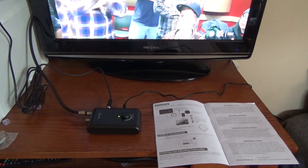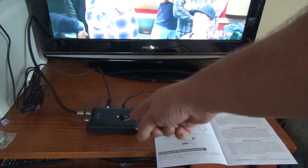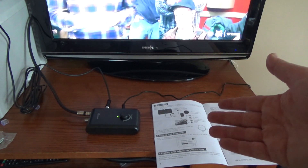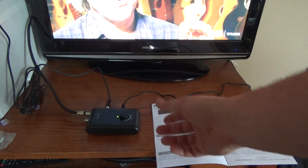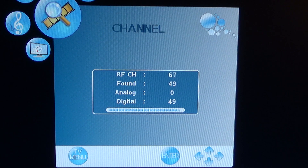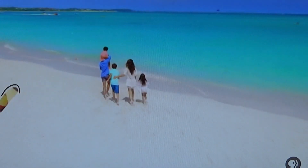We've got everything hooked up with our flat panel. I've got the gain or boost set to minimum. I don't actually know why or when you'd want to adjust that — it's not really covered in the manual, so this dial is a bit of a mystery. We're going to try it at minimum, maximum, and maybe in the middle, and just see if we get any different number of channels or any better quality. At minimum gain we can pick up 49 channels — more than the UFO got. But again, this is a directional panel antenna and I'm aiming it toward where I know there are TV towers.